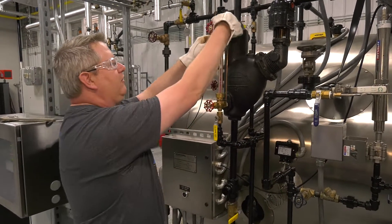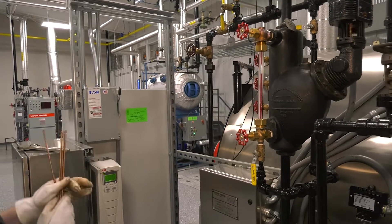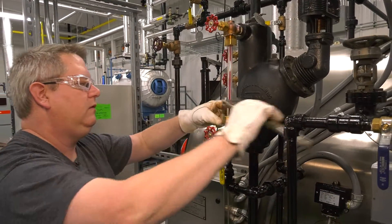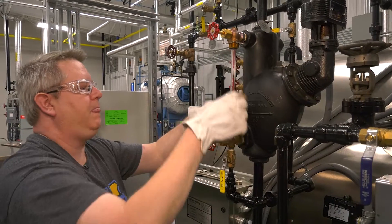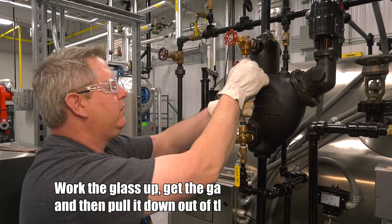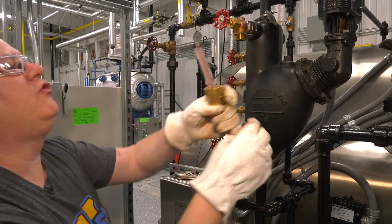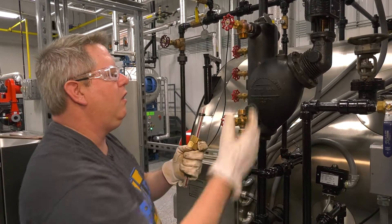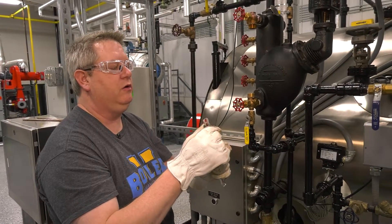First thing I have to do is remove the protection rods. These are generally here just so that we don't randomly knock the sight glass out. Secondly, we've got nuts here to loosen. That one was pretty loose. We've got rubber gaskets top and bottom that are forming our seal. We need to work the glass up, get the gasket out of the way and pull it down. We heard a little crunching there — it's actually pretty easy to chip the sight glass when removing it. So I'm not going to remove a sight glass unless I've got replacement glass and replacement gaskets. I always want to replace both; I never want to reuse a gasket.